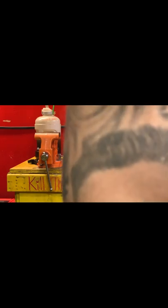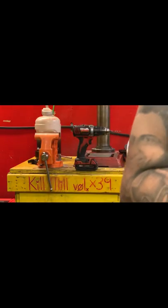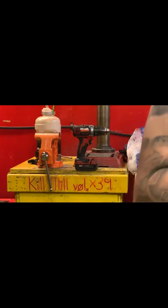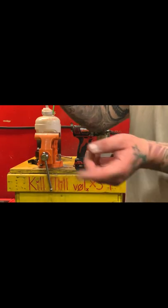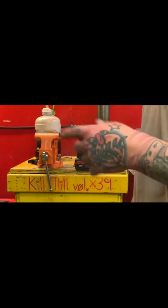Okay, so even though I measured that hose with the calipers, it may have been deformed a little bit, because that hole I just drilled with the number 25 seemed to be a little bit undersized, and I can't fit that other hose through it, even though I'm not sure which one I'm going to use. I'm sure that just wasn't an accurate reading or something.